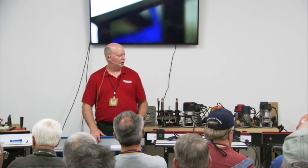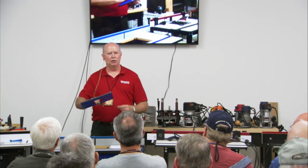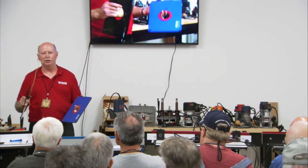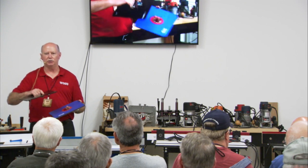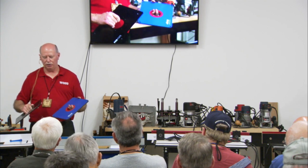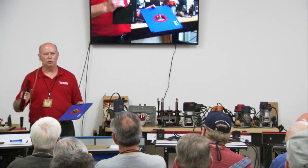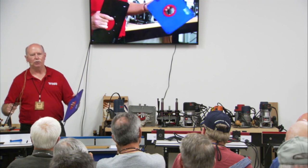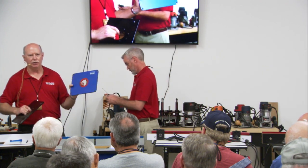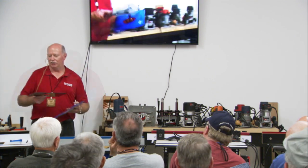The next thing is the insert plate — it can be as simple as this phenolic plate here. They also come in aluminum. Avoid plastic plates at all costs because they don't have the weight resistance and will sag in the middle. Phenolic plates are generally three-eighths of an inch thick to resist sag and work really well. Aluminum is typically a quarter inch — both work well for holding the router up without sagging. You can mount a fixed-base router right to the plate; you can mount a plunge base too, but it's just harder to work with — a fixed base is really the way to go.